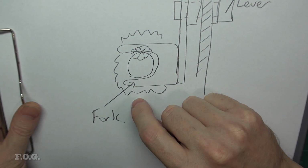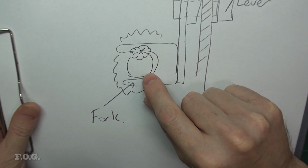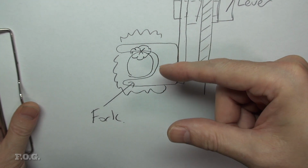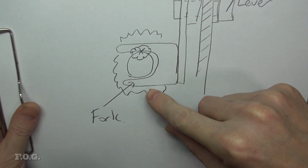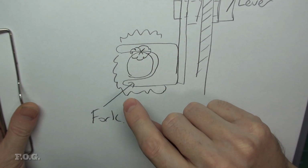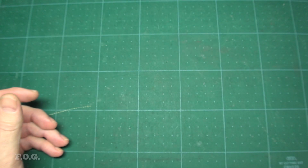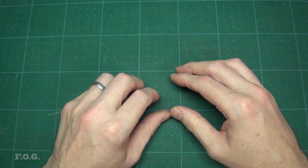So apparently the outer diameter for the race on the metal gear is larger than the original plastic gear. This is naturally worst at the neutral position where the distance to the race is the shortest. It's really pressing here. So to fix this, I filed down this problem spot on the fork by about 1mm, and then everything ran pretty easily enough. Anyway, let's take a look at some machining tests that I just performed after putting everything back together.